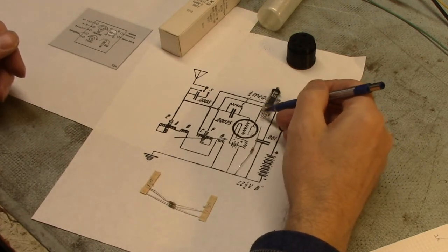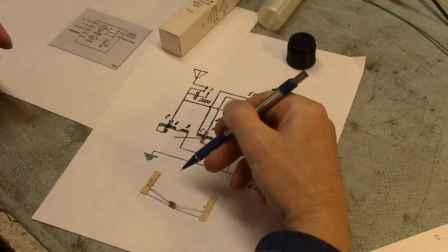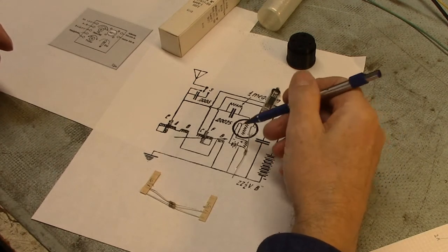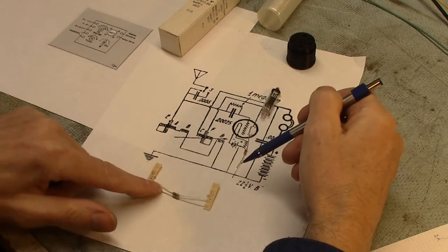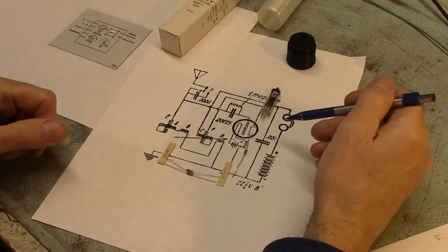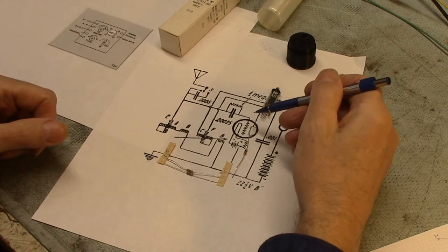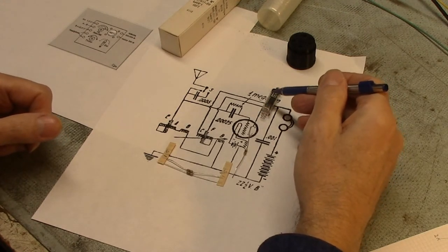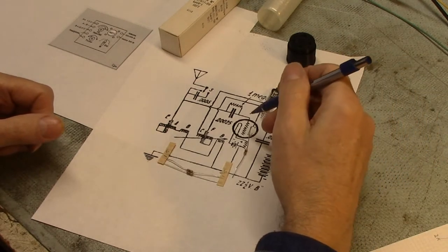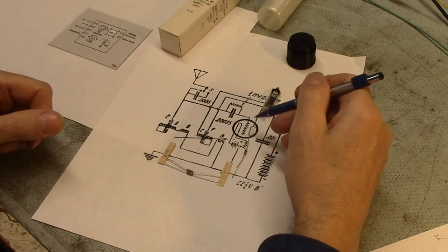I could do the first option, but with just a couple of resistors it's worth doing something better. The second option is series, which is certainly economical. The third is parallel shunt. I don't have quite the right resistor combination — I'll probably need two resistors in parallel, and the wattage is too low so I need double wattage. Looking at the antique radio forum discussions about using a 5676 as a drop-in for a WD-11, most folks suggest around 8 to 10 ohms for the shunt, though I've seen someone mention 22 ohms.